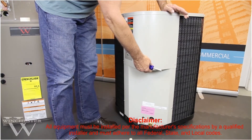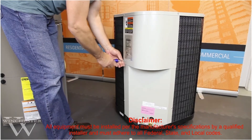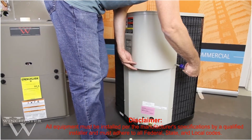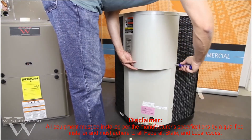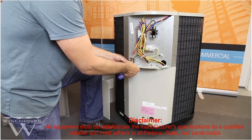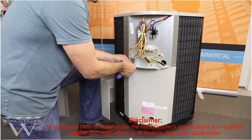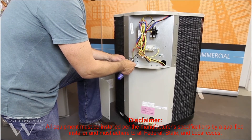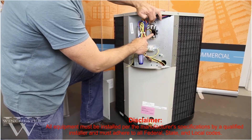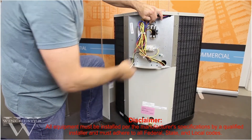Once connected properly it's ready to operate. I'm going to remove the access cover to show you what's inside and where you're going to make your electrical connections. The metal is folded in such a way to protect this area from moisture and keep water from flowing in. In this location are the two wires that connect from your thermostat wires leading back to the Y and C terminal on the control board of the furnace. When the system is sent into cooling mode these wires receive 24 volts, and when the condenser receives this 24 volts the contactor — a magnetic switch — engages the 240 volts through the condenser so the fan and compressor both start to run.